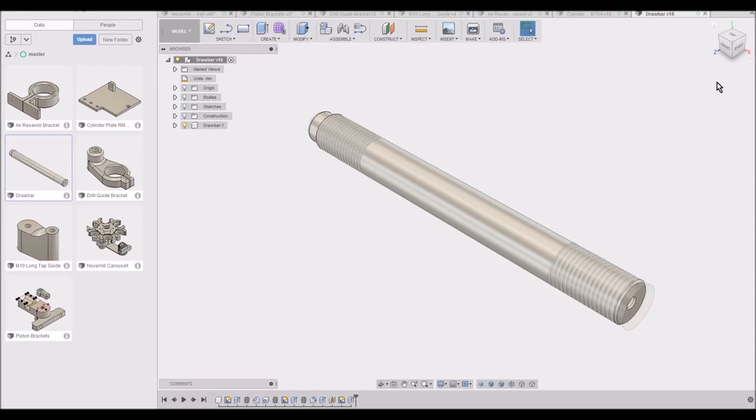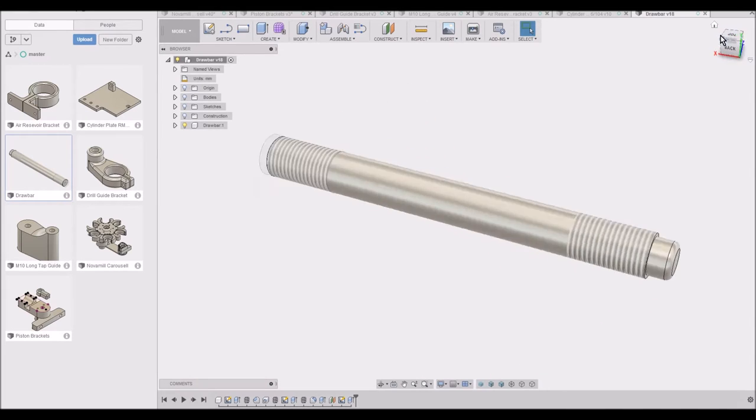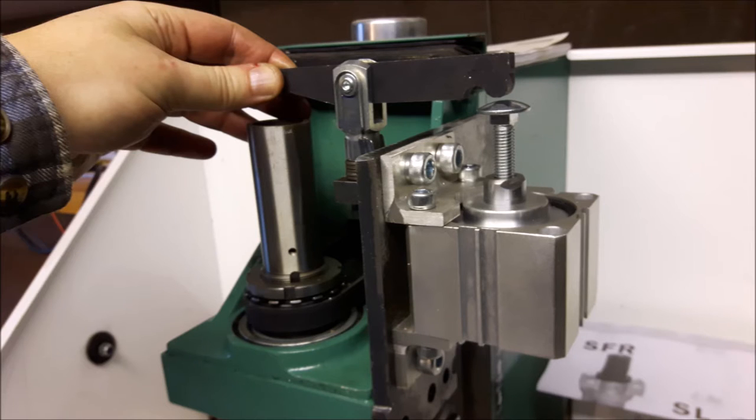The trickiest bit was the drawbar, which is slightly hardened steel, and I had some fun machining that. The approach was machining it enough to get a die over the top and then cutting the final threads with a die — that worked a lot better. The bolt on the end is just a stop for the tool holder. Then it was a bit of a dry fit to see how everything goes together, and then the big question was how to drill the holes in the side of that casting without taking it all apart.